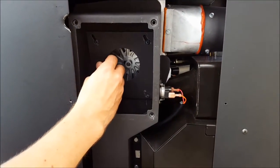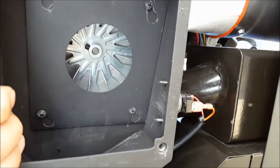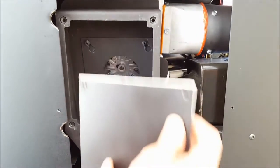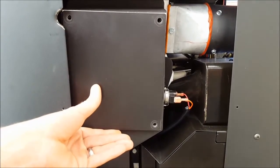Reinstalling your reducer plate, make sure you slide it down and to the right, ensuring there's no gap on that right-hand side. Reinstall your cover plate, ensuring your gasket gets a good compression seal.